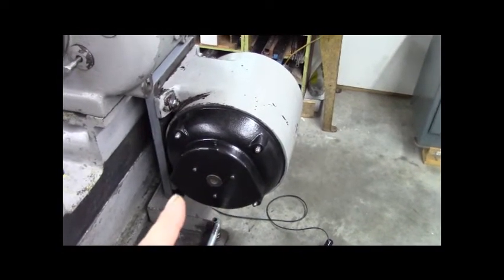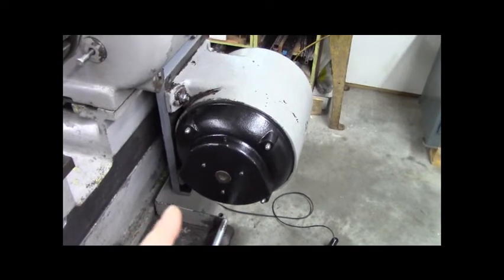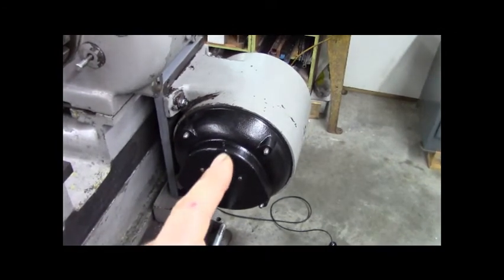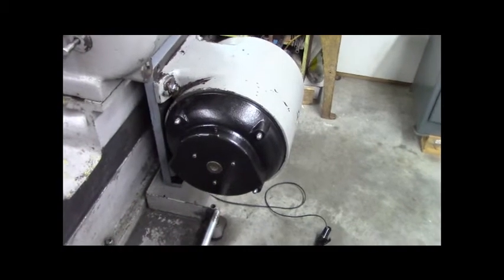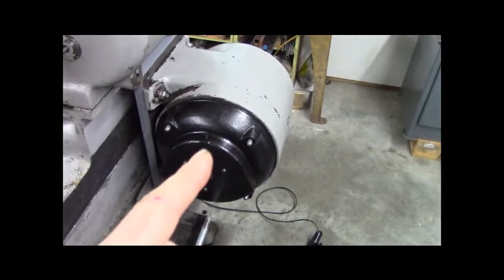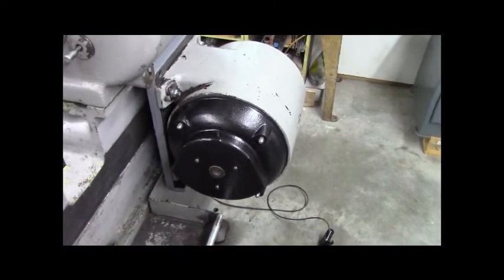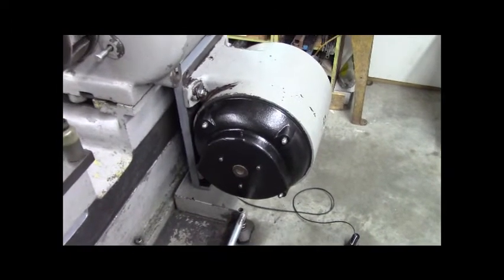I painted both end bells, cleaned all the grease off, cleaned the paint off, then painted them. I cleaned the grease channel and the grease fitting down in there — all the grease and gunk out. It was ridiculous. Then new grease, new zerks in there. The channel is cleaned so it's spectacularly clean.